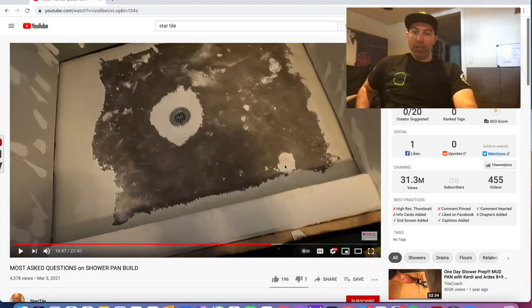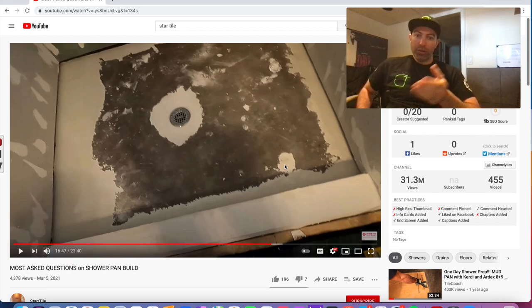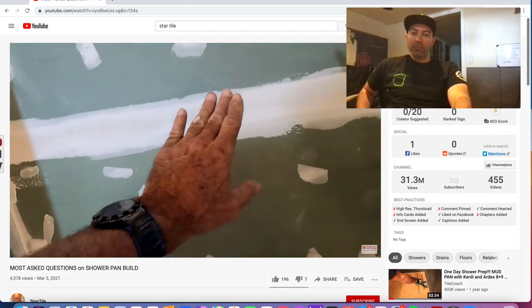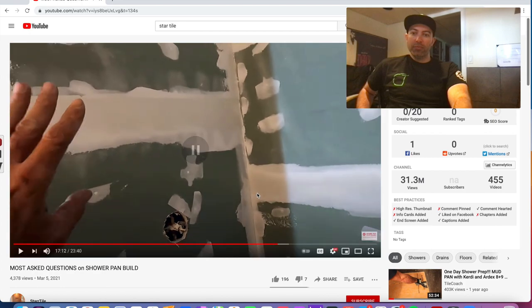no good. Yeah, don't do a water in, water out system if you're gonna be doing a topical membrane like he's doing here, which is RedGuard or liquid or a sheet membrane. You don't need to use the liner at all. And that drain, you won't use that. Use a Schluter drain, one of those new Flow Xcess, Laticrete, there's plenty of bonding drains you can use. Green board, which is gypsum, then yes, I use drywall mud.